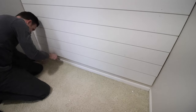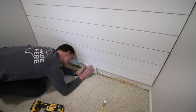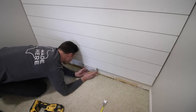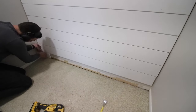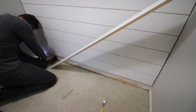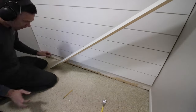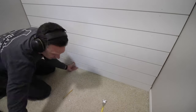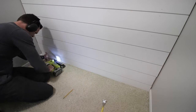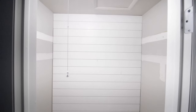Once I got to the bottom I decided to take the wall all the way down to the floor, so I cut out the bottom piece of trim. Then I grabbed a scrap piece of MDF shiplap to use as a test to get that width perfect. Once I got a measurement I took it to my table saw, cut it to size, and it's a great fit on both sides. I used my multi-tool to cut away the other trim so that the last piece of shiplap could fit in there nice and snug, then nailed it in.